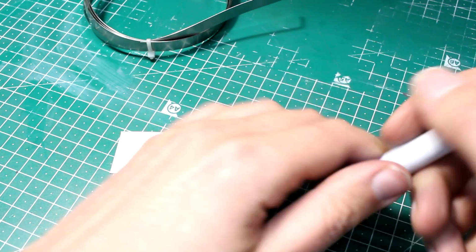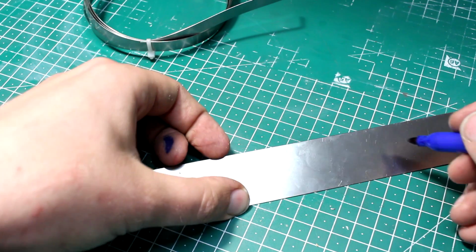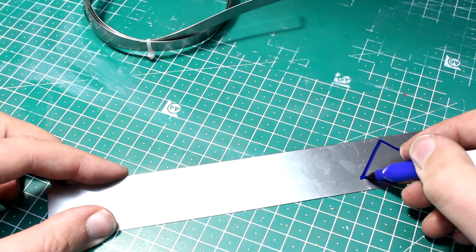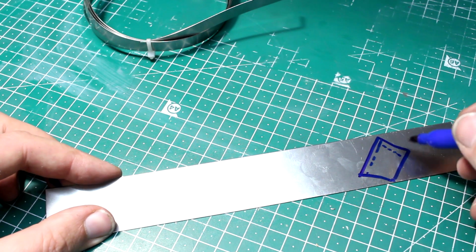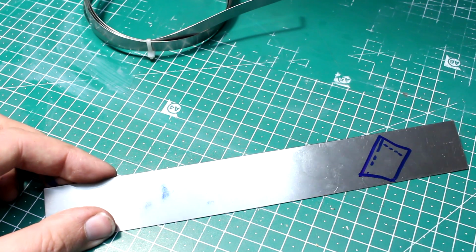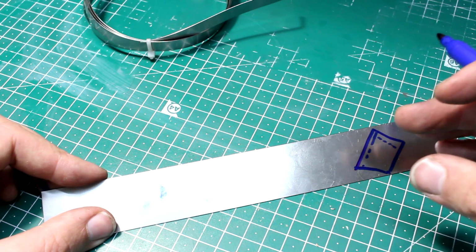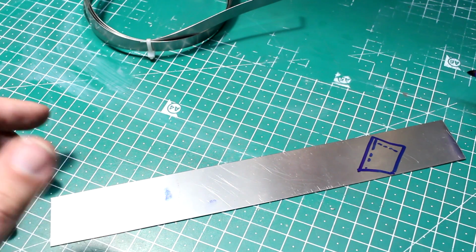But hey Stefan, I need a part that has two bends that are 90 degrees to each other. Well, that's a problem, but you always can cut the piece at 45, and then you can put your bend lines in like this. It's less ideal than having the bend line 90 degrees to the rolling direction, but better than having them in line with the rolling direction. That's a lot done with stamped parts that get die cut out of sheet metal and then bent. Mass production parts, that is.